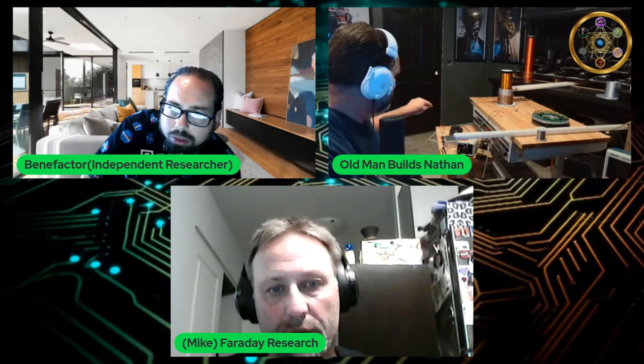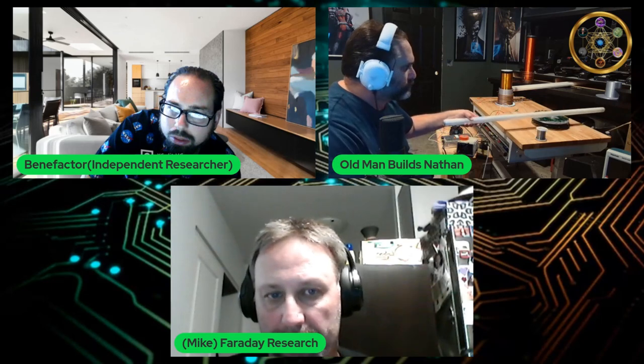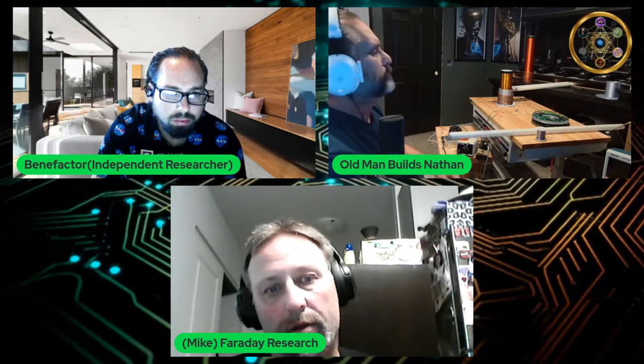Have you ever dabbled with transducers, Nathan? No, I haven't. I wonder what the effects would be with your Tesla coil with some transducers as a pickup. Say you have your Tesla coil and then a pickup Tesla coil on the other side. Then you hook it up to a full wave bridge rectifier. You step it down, so the second Tesla coil you would invert upside down. Get that voltage down as much as you can, maybe one winding. Hook it up to a full wave bridge rectifier and then to a capacitor or something that it could dump into a light with the transducer, and see if a frequency can actually be generated with the transducer on the pickup coil. You don't have to have them too far apart, maybe 6-8 inches apart from each other.